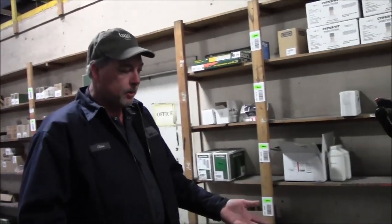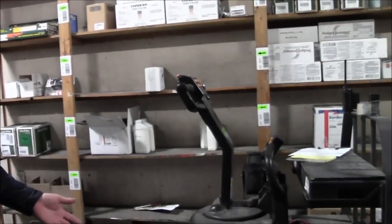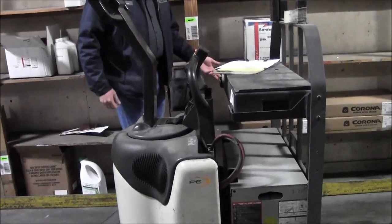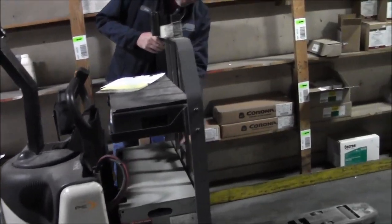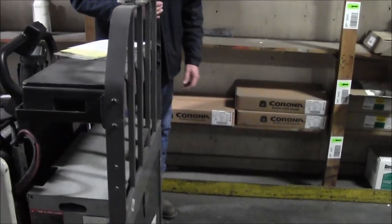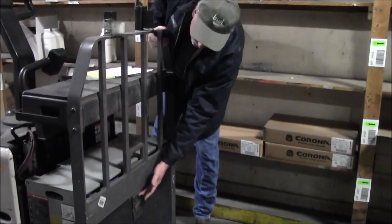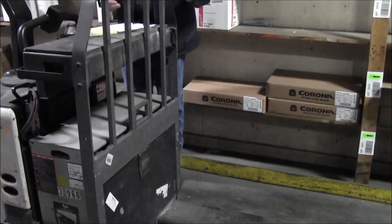Here's a quick run-through of the inspection I do each morning on the pallet jacks, forklifts, and stretch wrap machines. When I approach a pallet jack, the first thing I do is visually look at everything — walk around the side to make sure there's no damage on either side. Also check the latch; I've noticed sometimes the latch is not fully engaged, or a hinge gets bent down so the latch does not work properly.